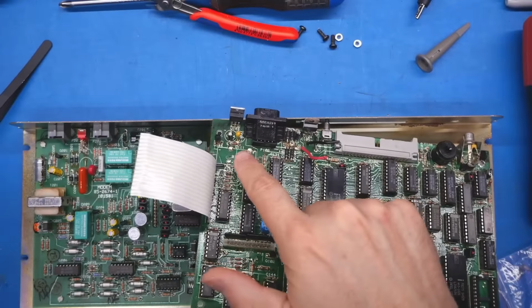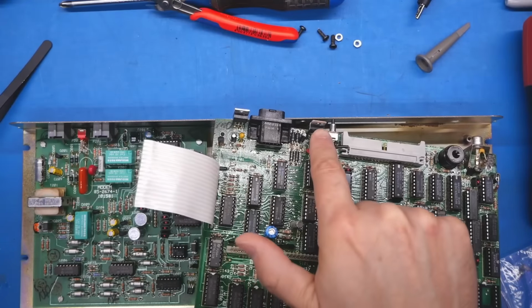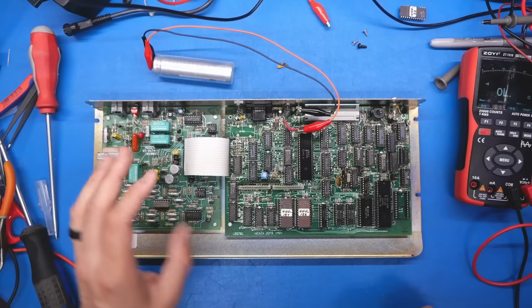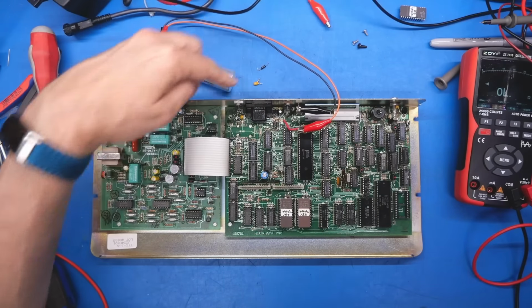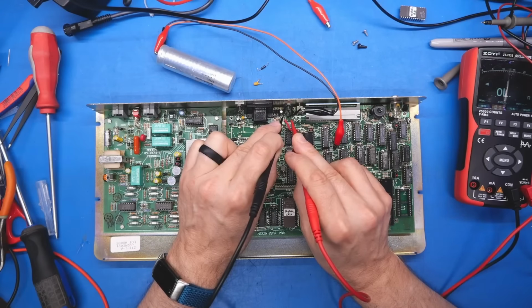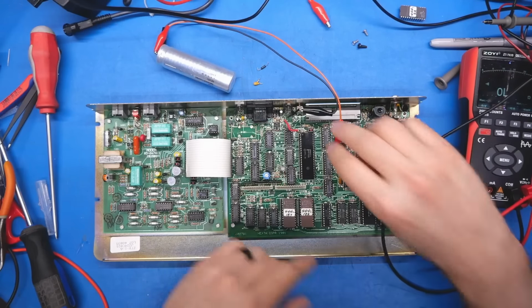Oh, great. So I've put two electrolytic caps in there, 4.7 microfarad, 50 volts each. I've reinstalled the voltage regulator, which is obviously not faulty. Well, we're pretty much ready for testing. Those are the two components that I've removed. Okay, so the board's back in. The voltage regulators are reattached to the back plate. We do not have a short any longer, so that is good.